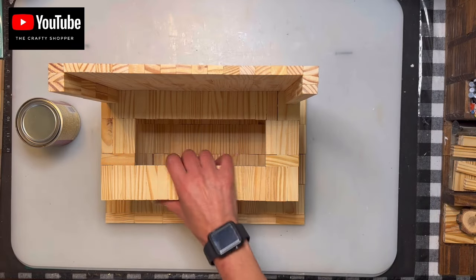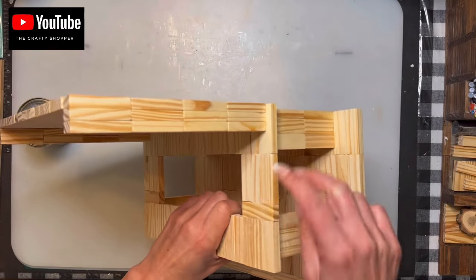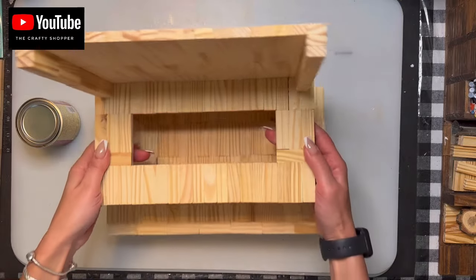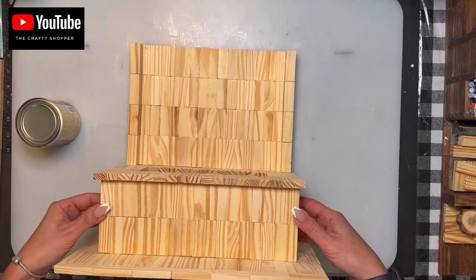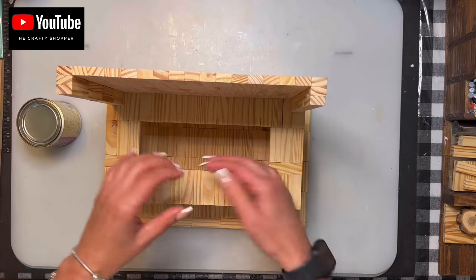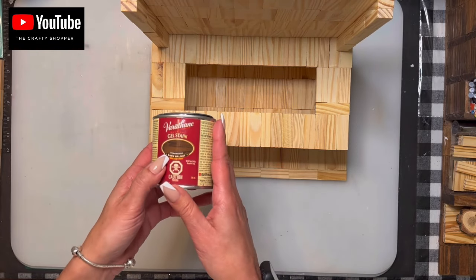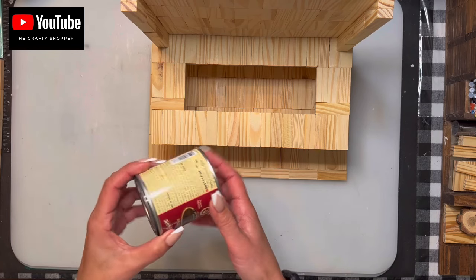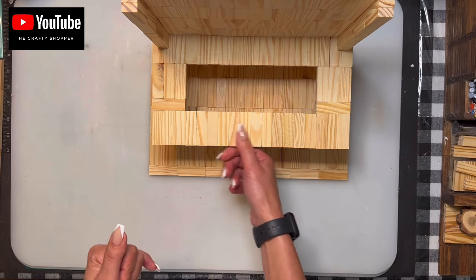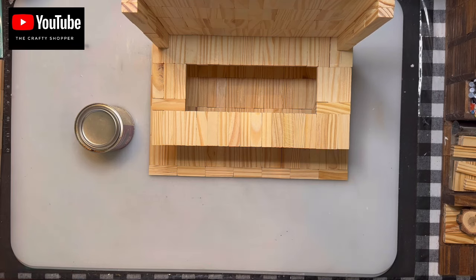I let it dry for 24 hours so it's solid. I originally was going to leave the four blocks out but wanted something more solid for the back piece since it's a little taller — drying time is key. Before we put the front brackets and the roof on, I want to paint it first so it's easier. I'm going to use this gel stain — dark walnut from Rona. With stain, make sure to buff out any little glue marks because the gel stain won't cover them properly.